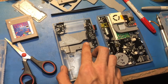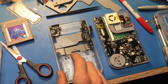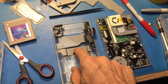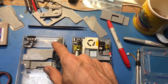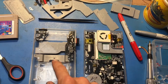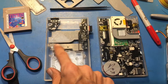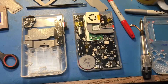I still need to have a cutout for the analog volume there. I think this could use some improvement — there's no relief here for the buttons, and my power button back button support needs to have some relief for the solder fillets on the USB port. But other than that, other than kind of changing this slightly, it gets my thing together and that's really my goal.